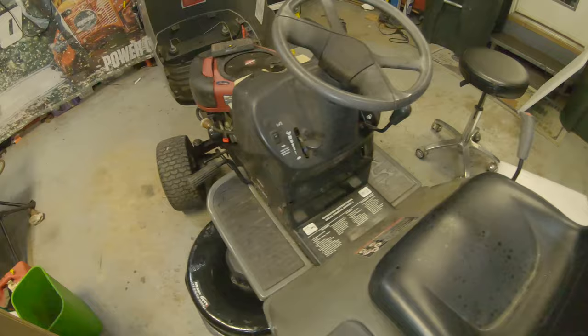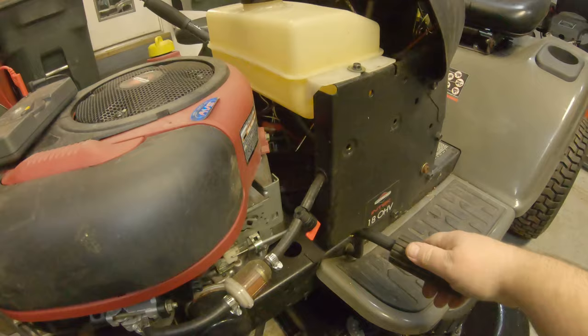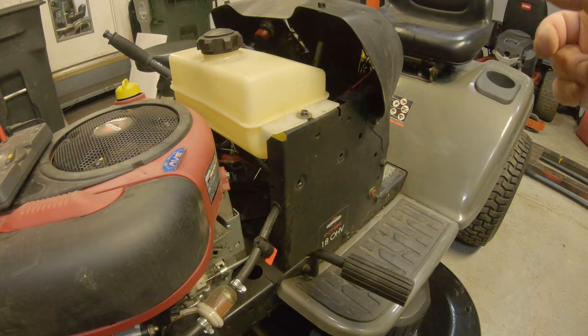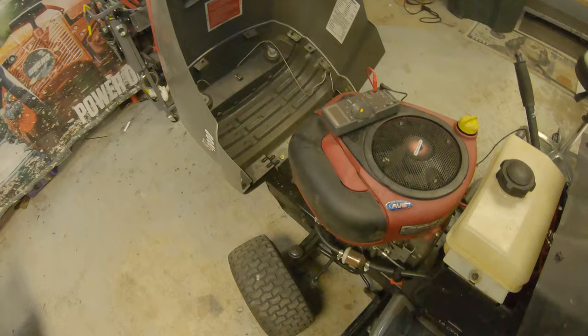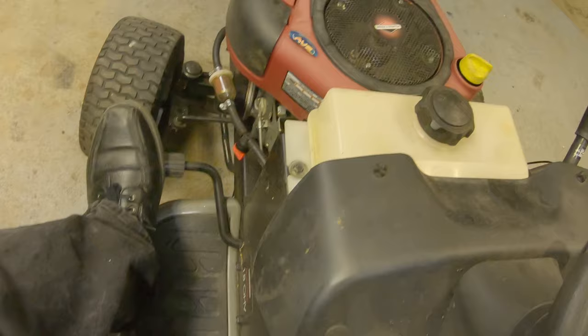There's another common safety switch that goes bad — on this brake pedal. It's located down in here; when you push this pedal down, it activates that switch right there. This switch here bypasses your seat safety switch, so when we test this one, we're going to leave the seat safety switch off so nobody's sitting on the mower. I've got my meter back on now — nothing on the seat. The seat will shut it off, but now the brake pedal, when you press it down, you have no continuity.